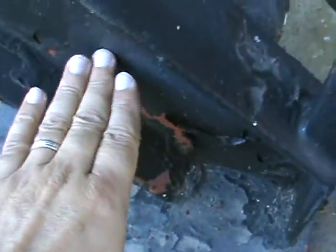You've got some issues down here. See, this is actually moving. I don't know if you can see it moving, but basically it's not connected. And it's rotting at the bottom there. So, once you get these feet done, I highly recommend that after we clean, we seal. We also put tar on this. It's not uncommon for us, after we get all this done, to tar these feet and then tar them 4 to 6 inches above grade, so that if there's any snow in this area, the tar stops anything from happening